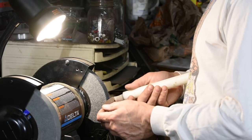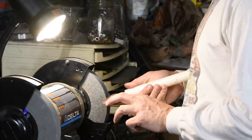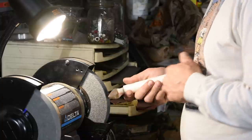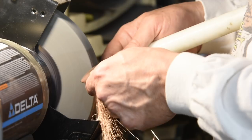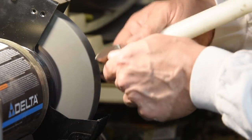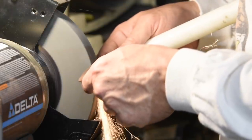I'll anchor the rod against my chest and sweep the blade back and forth against the grinder. By anchoring it each time in exactly the same place, I'm able to maintain a consistent grinding angle. I'm not sold on this approach, but if you're having trouble with the first method, try it and see if it works for you.